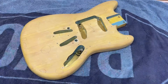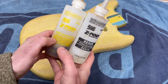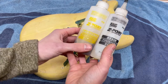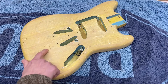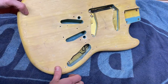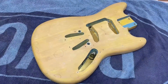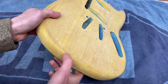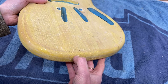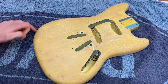I'm going to use two different types of filler. For the top surface I'll use Z-Epoxy finishing resin — a two-part epoxy-based filler. I use this for all my grain filling normally; it does a really good job because it doesn't shrink back and stays stable, so over time it won't telegraph through the finish. For the edges I'm going to use a two-part polyester-based filler often used on cars, because the Z-Epoxy would be difficult to apply neatly on those small edge dents without it running and making a bigger mess. I would use it on the top too, but I know the Z-Epoxy does a better job there and I know it's stable over the long term.